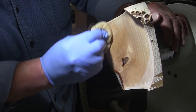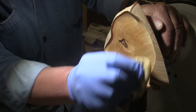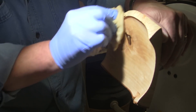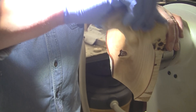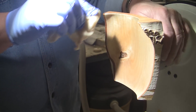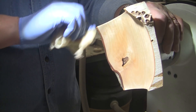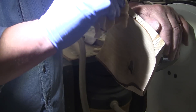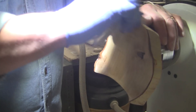I've decided not to spray this — I was certain that's what I was going to do. But I've been picking and peeling at the bark until I believe I have all of the loose stuff gone. So I'm just going to put sanding sealer right on the bark. These two ends that are unfinished, that are not turned, that have chainsaw marks — I smoothed them out just lightly with sandpaper. I like the texture of that. If you didn't know it was a chainsaw mark, you wouldn't know it. You feel it, and it just feels pretty nice.